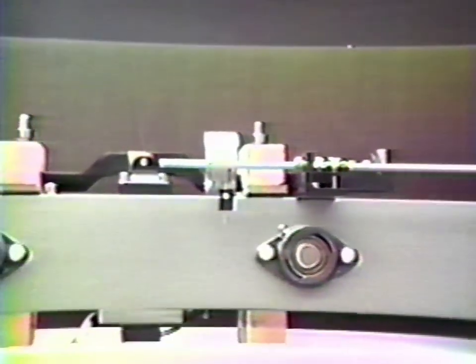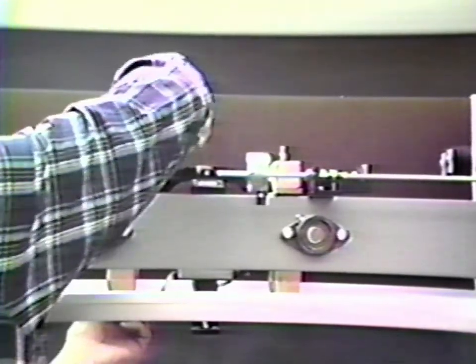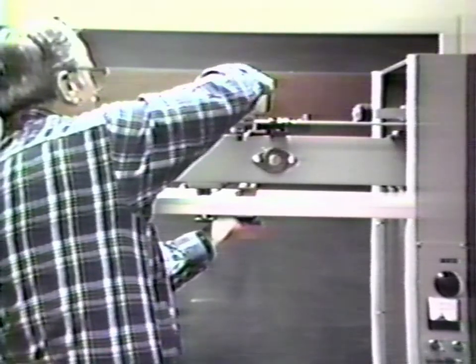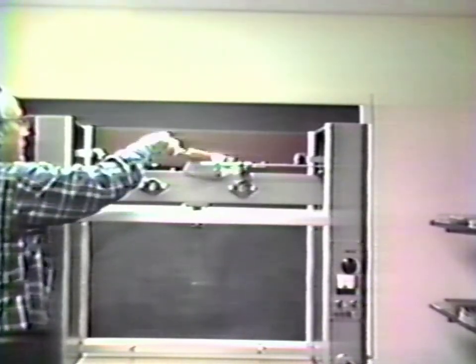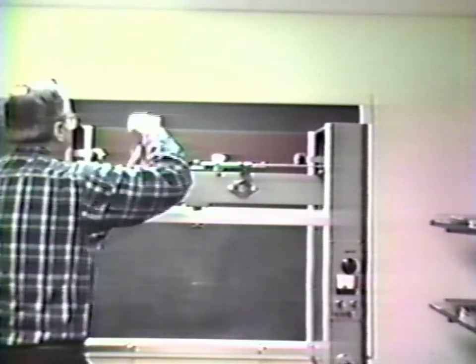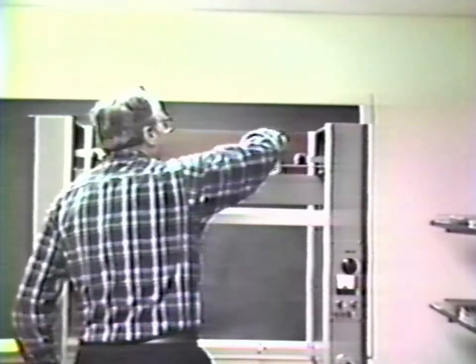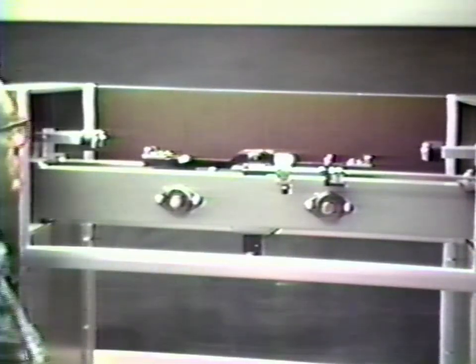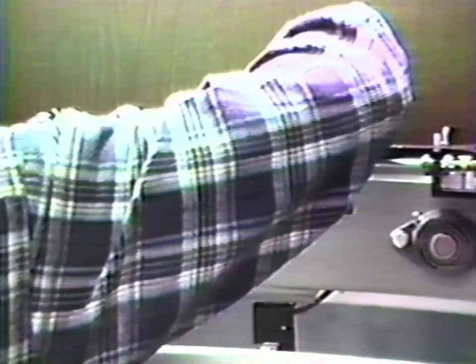Check the drum, and make sure that the chain which is suspended from the drum is not twisted or damaged. Remove the clamps which hold the pan arrest and the beam arrest in place. Remove all dust and accumulated packing debris from the inside of the balance case. Wipe the center bearing with a soft cloth to remove fingerprints and dust.